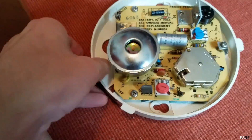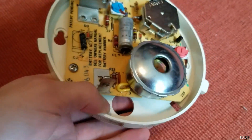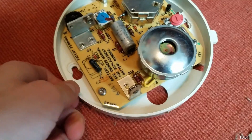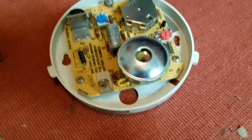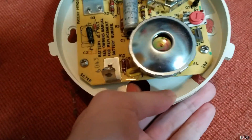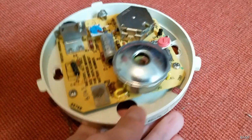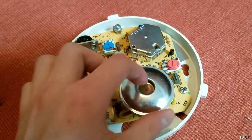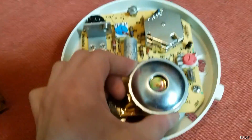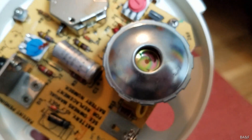The circuit board is screwed onto the base with three screws, and one screw goes to this metal plate under it — I'm not sure why. Here's your horn. I originally thought it was a Deltalarm horn, but looking closer it doesn't say Deltalarm on the casing. I'm beginning to think this is actually that oddball no-name horn used in a lot of Honeywell TC-49As, and I've also seen these used a few times in First Alert SA-769ACs, the plug-in models. They are not Deltalarm — they look kind of like Deltalarm because they have crimpings on the sides.